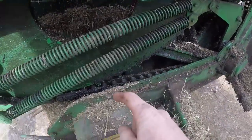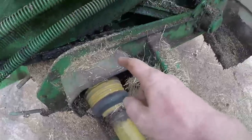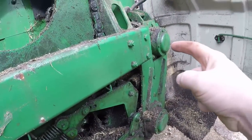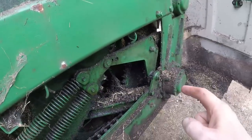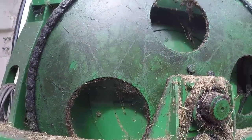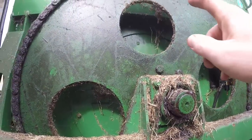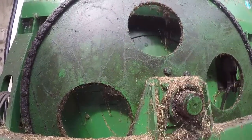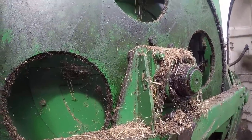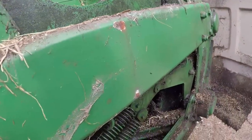So the shaft is running relatively quickly, like 400 RPM ish. That gears down slightly to run the discharge auger, and then gears down massively to run the rotor or the mixing paddle at about, is it something like 11, 12 RPM, something like that, this big cog to turn. And then obviously here is a big shaft, everything is running on.